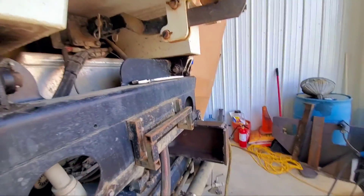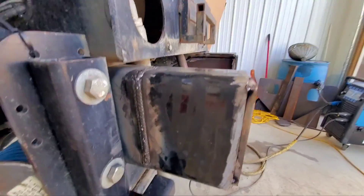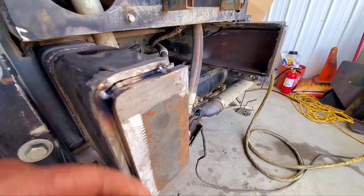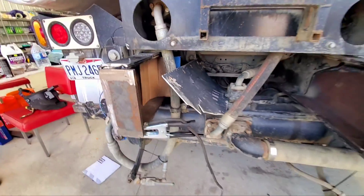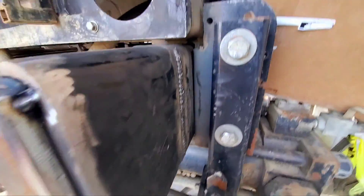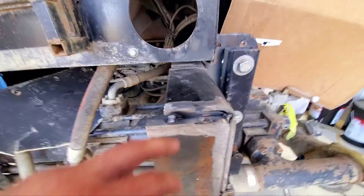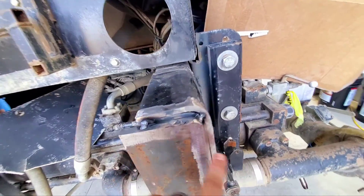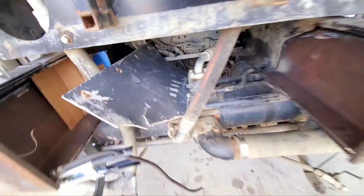So there's the frame extensions on. Some half inch A36 plate, tacked on, flushed up. We'll be running outside metal frame rail on this fillet weld and then we'll be running the inner frame rail back in here. That'll tie everybody together. And then we'll do some panel plate mock up. End of day 3.